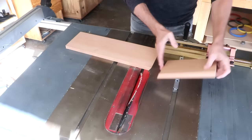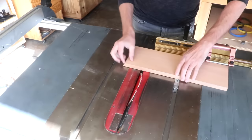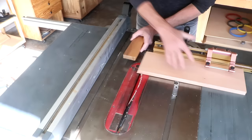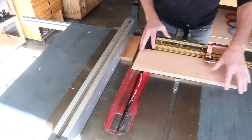Now what I want to do is cut out a series of strips in this piece that are all the same width as the thickness of this board. To do that, I want to set up a stop block on my rip fence. Remember, you don't want to use your rip fence in combination with your miter gauge unless you've got some sort of block that's going to provide some distance between the cutoff piece and the rip fence so that it can't get trapped and kick back at you.